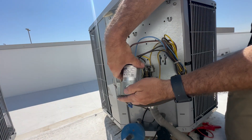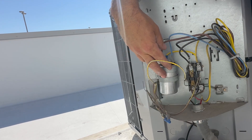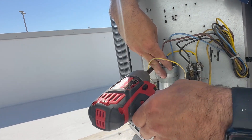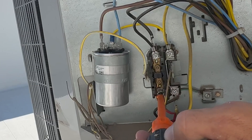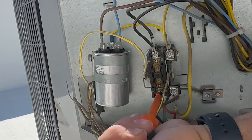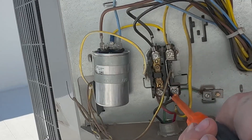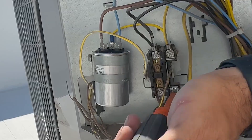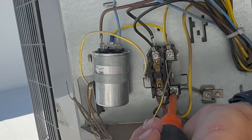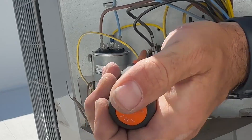It's also imperative that you strap these capacitors — don't leave them dangling, I see it all the time. Going to make sure there's no loose connections on the contactor. That one is very loose, I don't even need a torque wrench for that, and this one is extremely loose. You're not supposed to get a full turn out of these lug nuts. These ones are good.